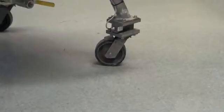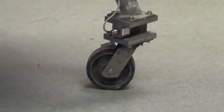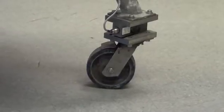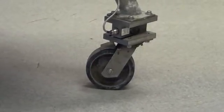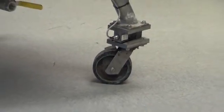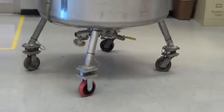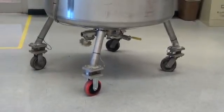Notice swivel casters have an offset wheel, which creates a pinching action on the load cells. Standard load cells only take vertical forces on the Y axis. The moment correction compensates forces on the cell from other than the Y axis, and only allows the forces in the Y axis to be felt.